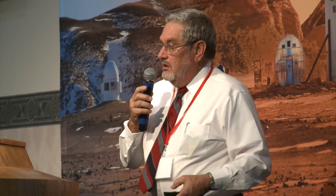This is the ramjet liner right here. It's about three inches long, about an inch and a half inside diameter — real small — about two tenths of an inch thick. It did just about the same kind of low conductivity insulation job that shuttle tile does. I even made the nozzle out of the same material. What you're looking at is a liner that went into perhaps fifty to a hundred rich instability blowout problems, several dozen tests, and I accumulated more than five hours of burn on that thing. This is what it looked like when it came out — it looked like that when it went in.